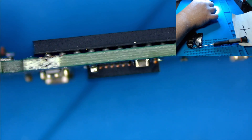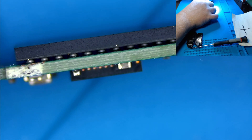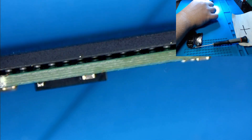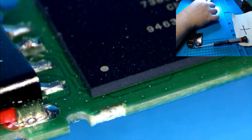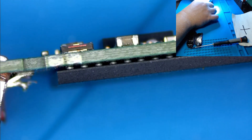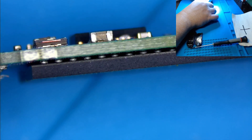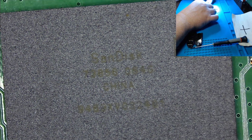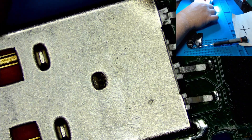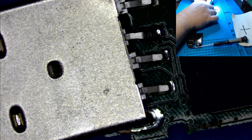Here's a side view — you can see how this is lifted up and bent. You can also see the ball grid array underneath our BGA chip here. Hopefully there is no damage to that — that's going to be the kicker. If this is damaged we could attempt to reflow it, but this is our memory chip, this is what's storing all the information we need. Hopefully there's no issue with that. I'll get this removed and we can go from there.